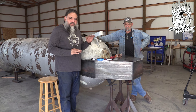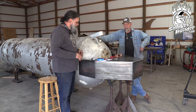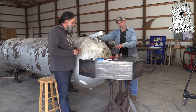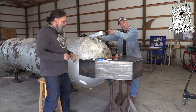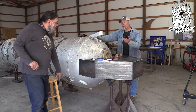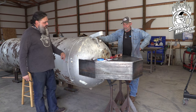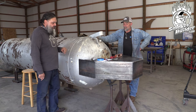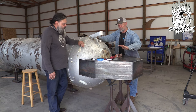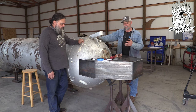That stiffener will remain the same height during all of this processing. We won't take it out until this thing is tacked and welded in place. Once we've got doors cut on the cook chamber, we can access it from the inside and cut it out and remove it after it's welded — kind of like a car roof. This thing is going to shed water; it's not going to sit down in a pool. We're not going to have rust pockets and stuff like that.